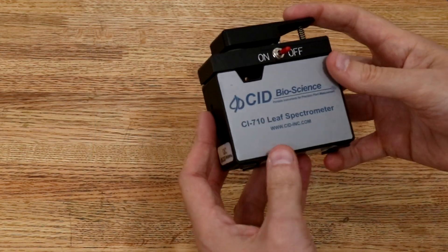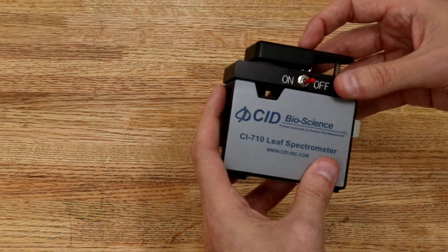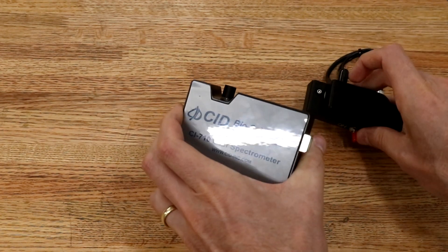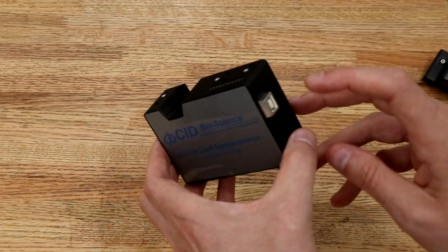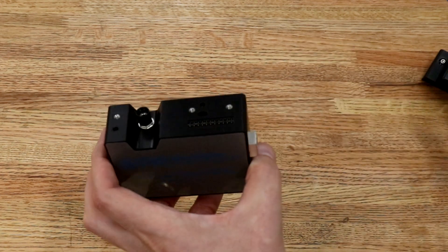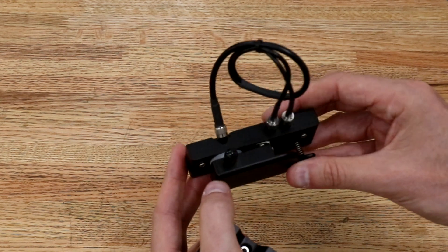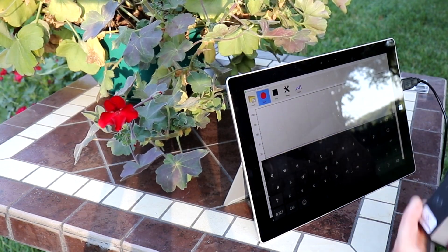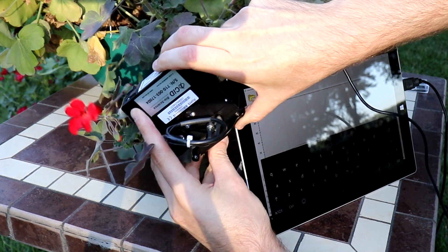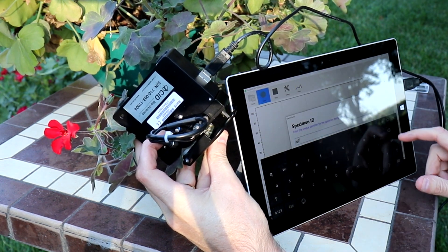This is the second spectrometer that we'll look at. This spectrometer is from CID Biosciences. The actual spectrometer is from OceanOptics, just like the ISA card-based spectrometer that we looked at. The ISA card interface has been replaced with USB, and there are pins on the top for digital I/O and power. CID Biosciences uses those to power their lighting module. This spectrometer is a nice example of an OEM module being used for a specialized application — in this case, measuring the relative concentration of plant pigments based on the spectrum of reflected light.